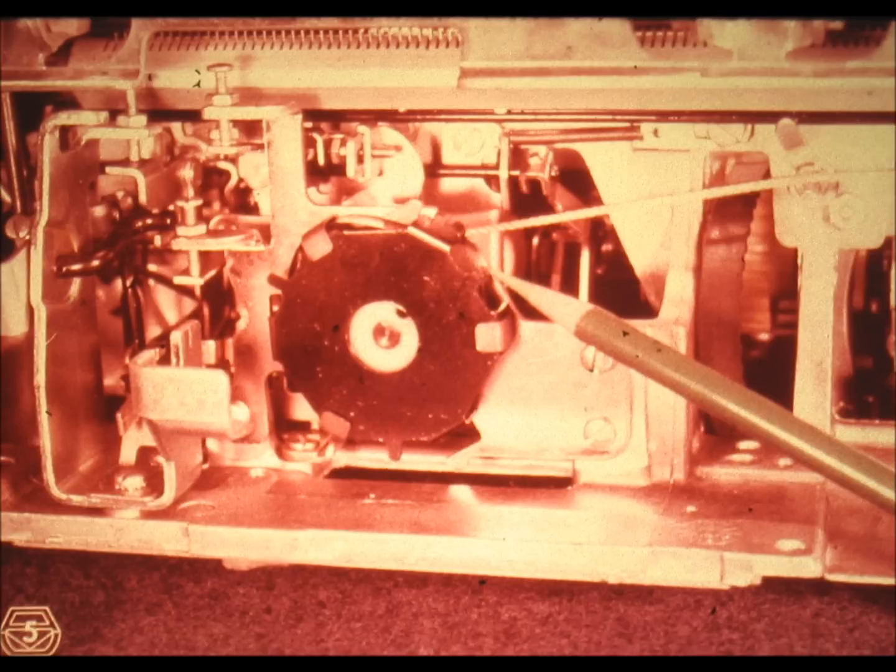For the positive power coming from the motor, we use ratchet clutches and spring clutches to tap it. For the negative power coming from the spring, we also use a form of clutch — it is called the escapement mechanism, which very simply allows us to use some of the power stored in the mainspring. Notice the size of the indicated ears on the cage of the mainspring.